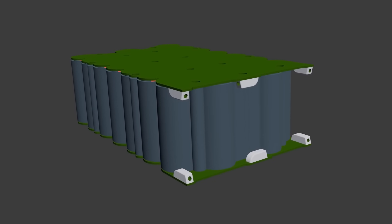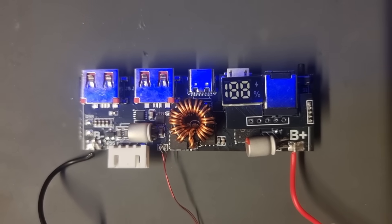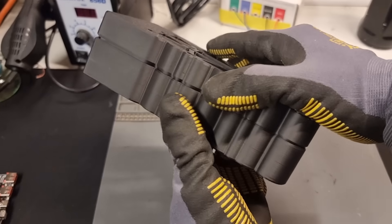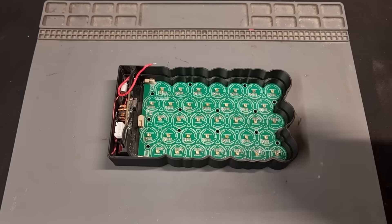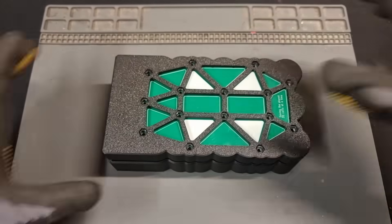This is going to make the construction, servicing and cell replacement much easier. We also have the 100-watt fast charge USB board that we can buy from AliExpress, and finally the 3D printed enclosure which is resizable so we can use it for longer or shorter vape cells. All of these parts stack nicely together to build up the complete power bank. All the design files and links will be available in the description.